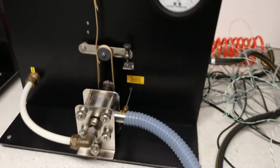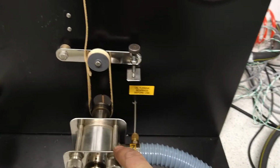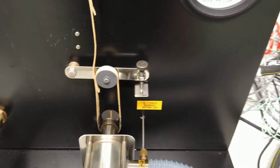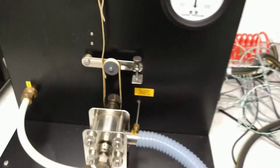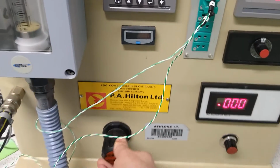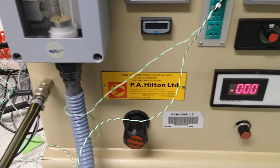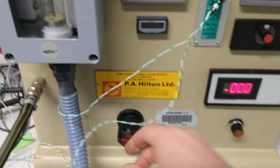Okay, so if I start up the compressed air supply to this, as it increases in speed up to, let's say, an initial value of 20,000, it will get quite loud, so you may not be able to hear my explanations. So I may need to put in a voiceover or something like that afterwards. To increase that pressure, I'm just going to adjust this here, and I'll bring the pressure up. I'm not sure the actual value we'll need, but I'll bring the pressure up enough such that the no load speed of the turbine is 20,000 RPM.